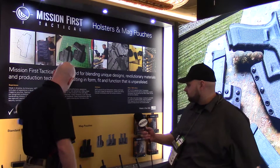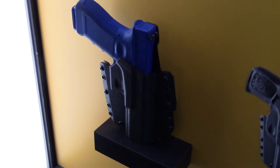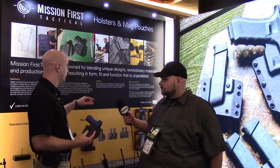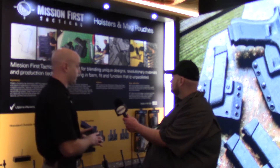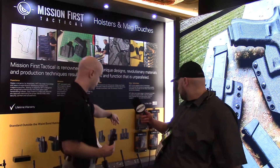We're starting with 24 models this year, and it is a very sophisticated, different type of forming than what the industry is somewhat used to. We start from a very sophisticated mold underneath that's vacuum pressed over, then we CNC cut our two pieces, hand rivet them together, hand polish the outsides so they get that real handcrafted custom look to them. Then we clean, finish, install, and put it in a very nice, attractive display box.